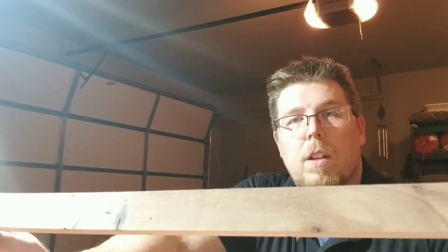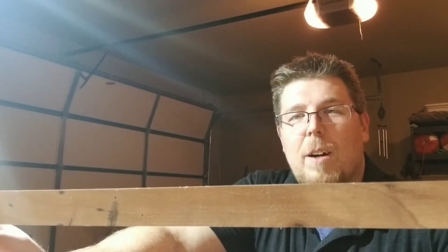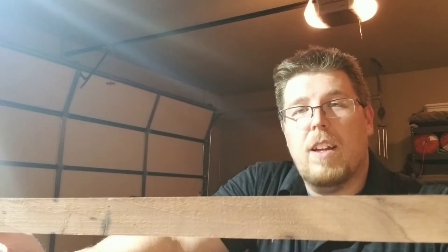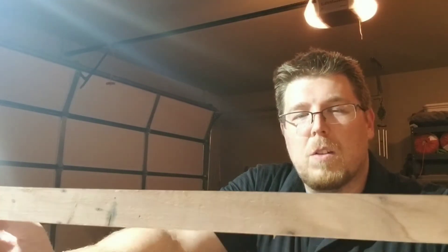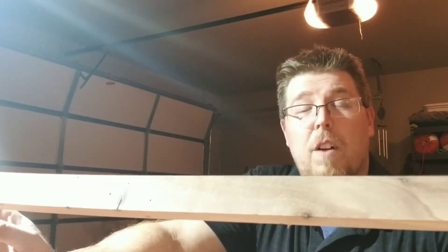The next one is pecan. I actually came into a lot of pecan for a project I did very recently, and it has a very unique characteristic. A lot of woods will change color when you put finishes on them — whether it's teak oil, boiled linseed oil, or something like that. Right now this board looks mostly one color, but after you add a finish, it's very likely to emphasize two very different colors: a very dark streak running through it, and also a lighter portion. It almost acts as though the oil can't penetrate certain portions of the wood. Pecan is a very beautiful wood whenever it's finished.